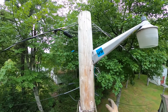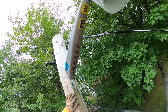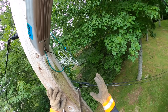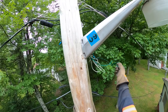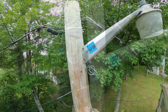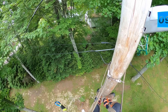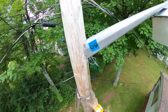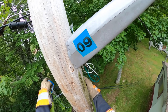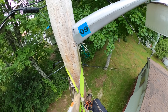All right, so we're up into our work zone now. I could probably do everything from here, but we're going to belt over the communication lines to get into the work zone a bit closer — it's going to be much easier on our back to start work. On my belt I do have a retractable type lanyard, so you want to be belted in at all times — we're going to simply cross our lanyard over top of the obstacle.